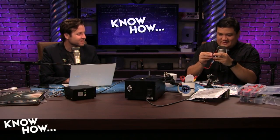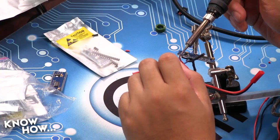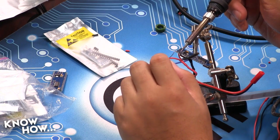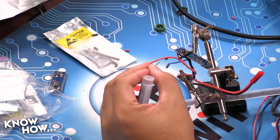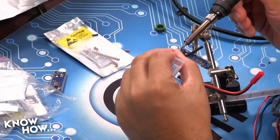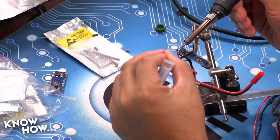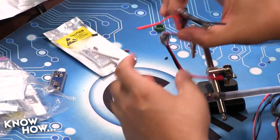Yeah, we didn't really give ourselves much of a lead on the wire there, did we? This is why you always want a service loop. You should always assume that there's going to be a problem and you're going to need a little bit of extra wire. All right, so we're just going to tack this in. But yeah, you're right. This is why I like to breadboard, because breadboarding is much less susceptible to just breaking off. When we did this whole soldering to the Nano project, I should have attached it to the picture frame and really locked everything in, because it's been just floating outside of it. Let's make sure that's actually there, and that I haven't bridged. Okay, yeah, you're good. Cool.